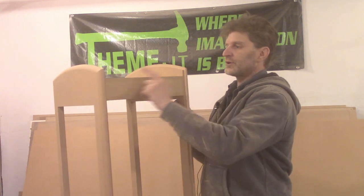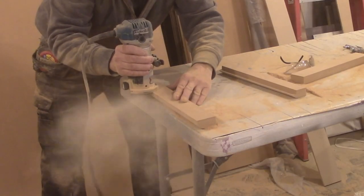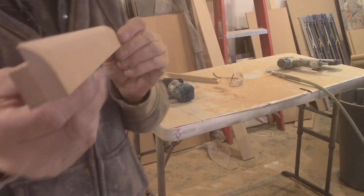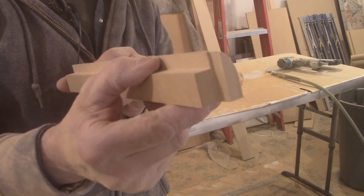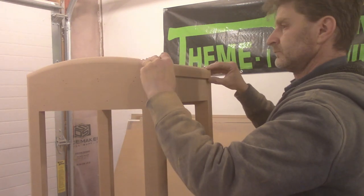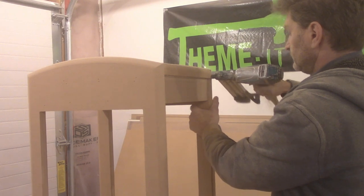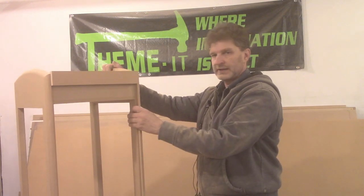We need to make a bridge across here, and it needs to be a radius so it follows a nice curve. The hardest part about this is you've got to rabbet and router out a groove, plus you need to router out your radius here as well. I'm going to make them a little bit wider because wider will be easier to work with. I need to sink this piece in and router it along this edge to make it look flush and symmetrical to the whole cabinet.